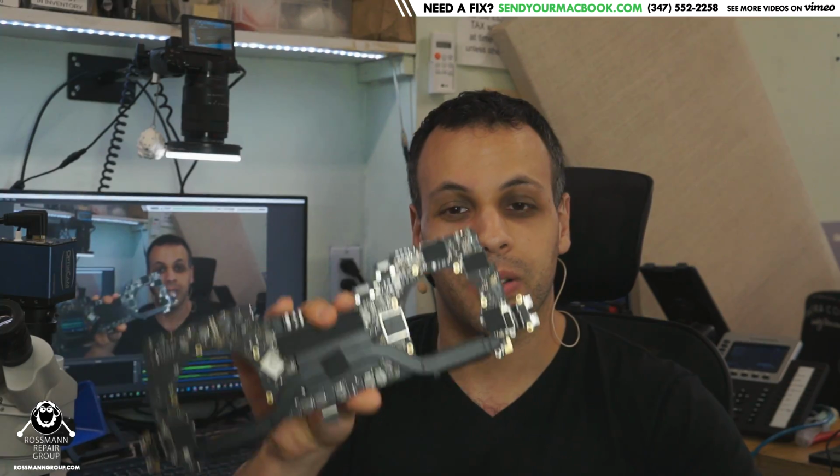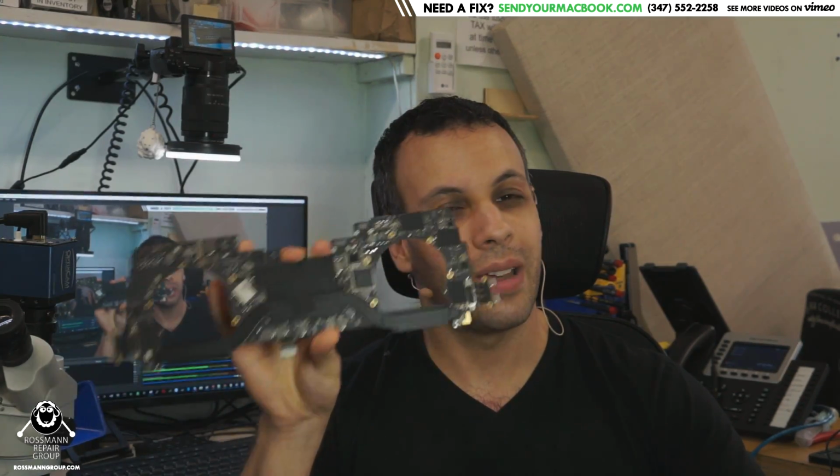For the past 7 years, I've been going over every single practice that this company uses to make it more difficult to repair the machines. I've been going over every single thing they do every single year to make a machine that fails easier than other models. Whether it's the 2010 with GPU kernel panicking failures, 2011 with actual GPU failures, 2012 with the GPU works, but the chip that powers it just comes off of the board, and their idea of fixing it is to put a little piece of rubber there.